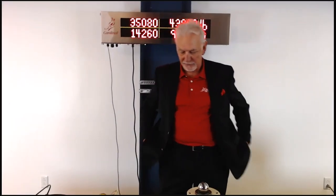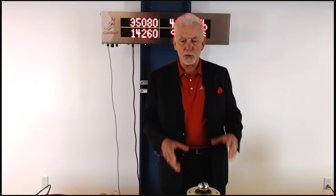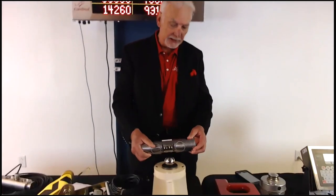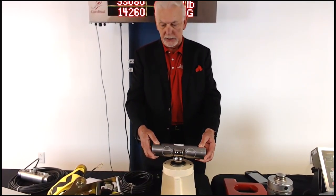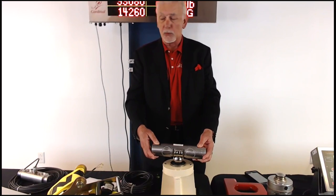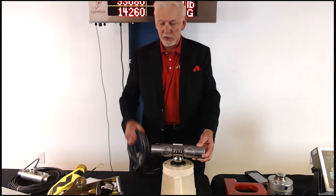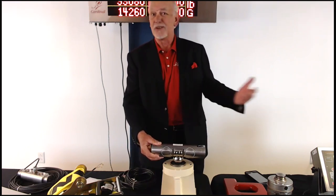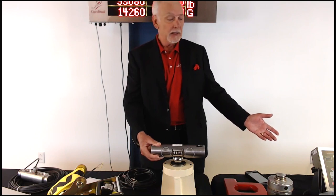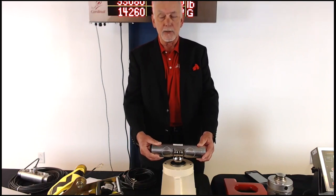Before we go any further, I just want to point out a couple of things that we've realized. With the creation of the new Armor portable truck scale in 2017, we've eliminated all the debris issues. We've made something that's very easy to repair, as John and Luke were speaking with us about. We replaced the actual junction box from the scale. So there's no power to the scale at these remote locations for a rental, just the home run cable to the 225. And typically, as we calibrate the scale in the factory, you don't even have to go into calibration of the 225. And we offer the very simple USB device for data storage for truckloads as they come in on a daily basis.